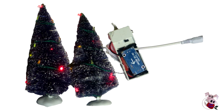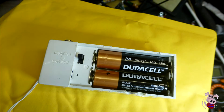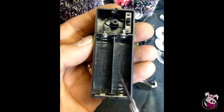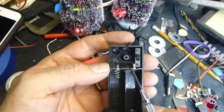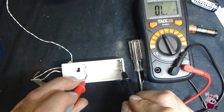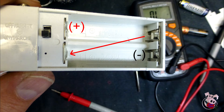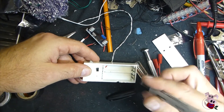The technique to convert battery-operated accessories requires LM2596 buck converters, a multimeter, and some soldering. My two accessories are both controlled by two AA batteries — meaning 3 volts. One had an external power supply option with a connector you can't buy anymore, and the other had no external option at all. To connect to the battery connection, open your battery box — if the bottom plate is solid then positive and negative are at the top; the one with the spring is negative and the one without is positive. In a white fixture where the batteries go in the same direction, use a meter connecting negative on one side to positive on the other to find the crossover, then identify the remaining two posts as positive and negative.